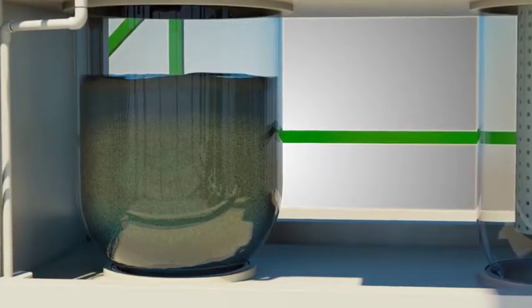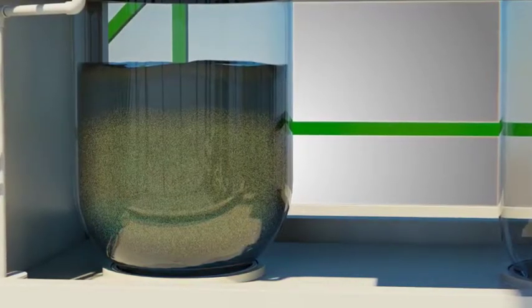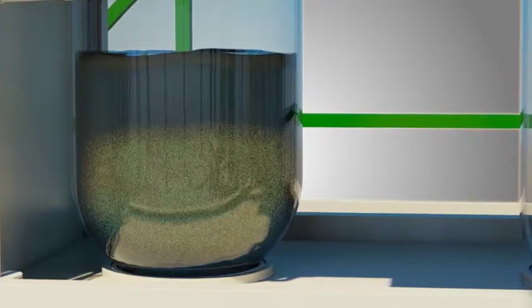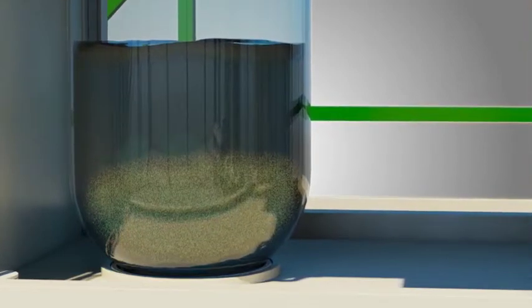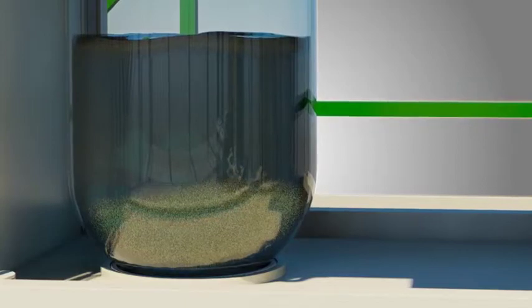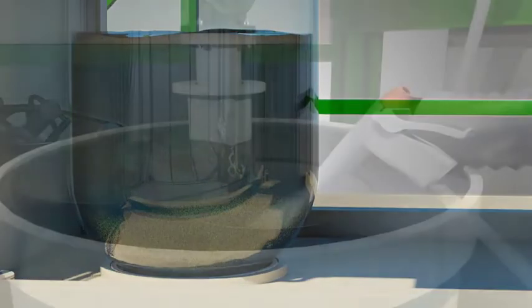At the end of the charging, yellowish, shining gold crystals are seen sedimenting at the bottom of the reactor, whereas the solution turns greenish-blue and transparent. Aeration is done from time to time to ensure proper agitation in the reactor so that the reducing agent metabisulfite reaches the entire mass to precipitate gold.